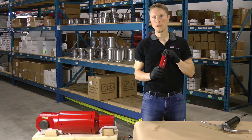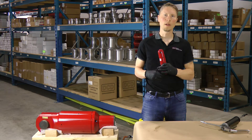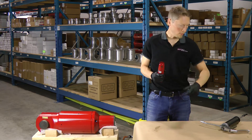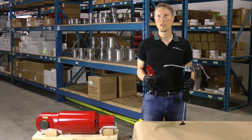So you want to select a grease that's compatible. DCD uses and sells a lithium complex grease — it's the Renolit S2TX — but we have a table of compatibilities. In case you use a different grease, just make sure it's compatible, and you're going to want something with EP additives.